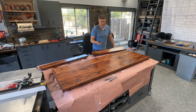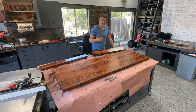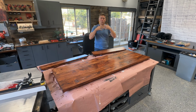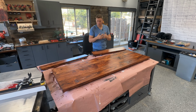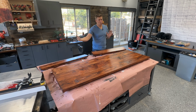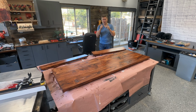However, for me, I actually am thinking it looks too nice. I want it to have some imperfections, right? Look around this place, right? My boards aren't perfectly aligned, but that's that rustic farmhouse style flavor that I'm desiring. So it's been 4 hours, I'm going to recoat it as is. The two chemicals will still bond to each other because this isn't officially or fully cured out, right? So it will still bond to it, and you have that recoat window of up to 12 hours if you're wanting to do that. So let's go ahead, let's get started.